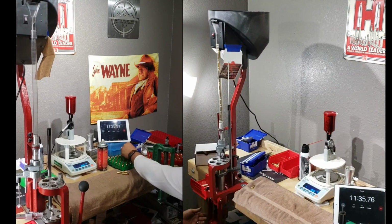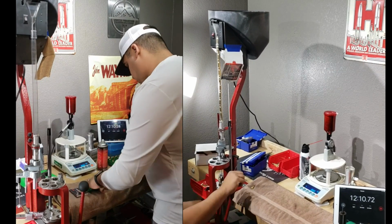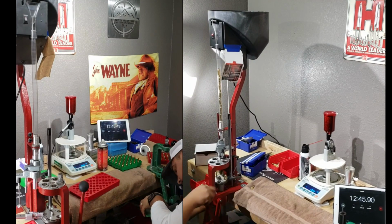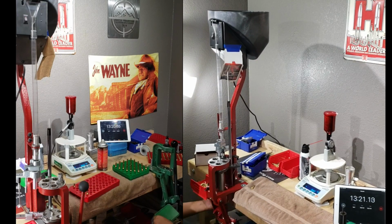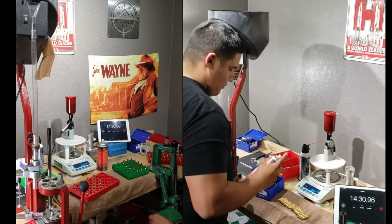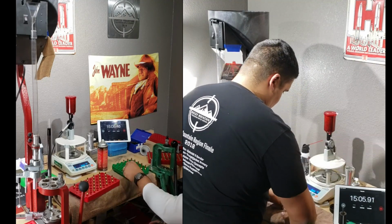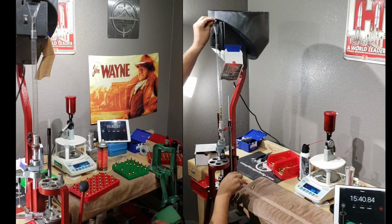As you see on the right here, I'm only about halfway through my brass currently in the single stage, where for the progressive, it's once I got that primer going. And one thing that I forgot to mention was that there was a little bit of a hang up. There's a pin there that, if you notice on the back side of the press, is a rod that makes the shuttle for the primers function, and I had a little bit of a hang up trying to get that thing working, because usually I turn that off. I pull that out while I'm seating.